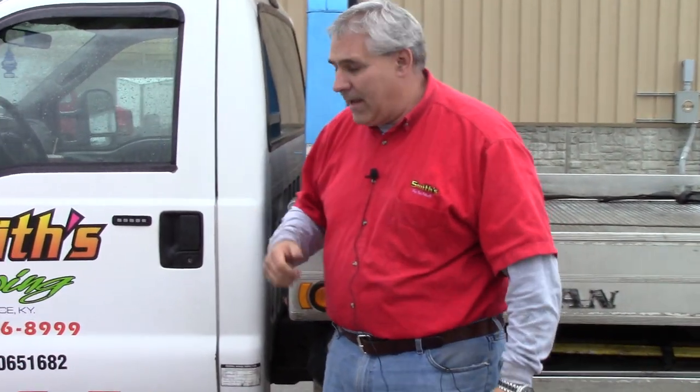What I'm going to teach you is a way that if you've never towed before, if you follow what I'm going to do right now, you'll be able to back up to your very first car your very first day and look like you've been towing for years. First thing: we're going to fire the truck up, roll the bed all the way back and put it on the ground, then we're going to go back to the Mustang. I'm going to take steps from the back of the bed to the tire, count them, then mark it so you know exactly where to be.